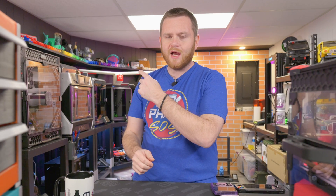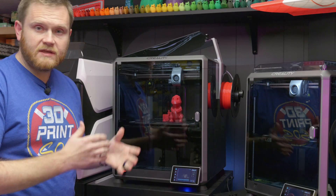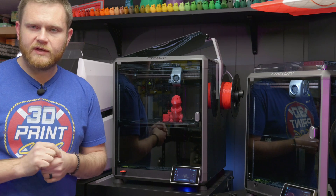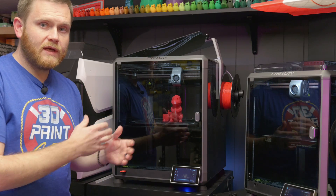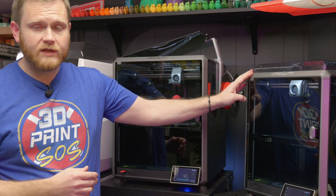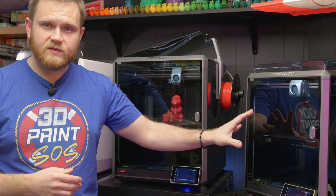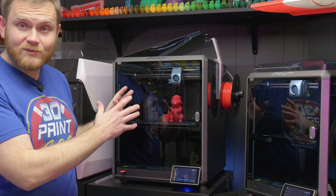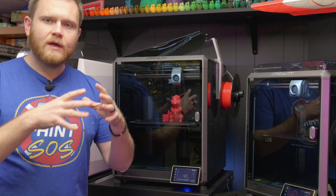Some of the main things I want to cover are to give you an idea of which direction to go if you're hunting around for a 3D printer nowadays, because I believe all three have their strengths and weaknesses and all three definitely have their place in the market. Let's hop over to the first machine, the Creality K1 Max. This is my example of a decent Core XY machine — specifically a 300x300x300 Core XY machine, which at the moment is actually rare. For comparison, this is the Creality K1C, a more traditional 220x220x250 sized machine, and as you can see, this 300x300 machine isn't that much larger. That compactness is actually one of the strengths of the Core XY type of machine.